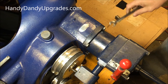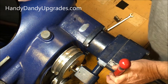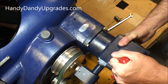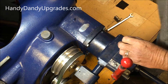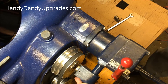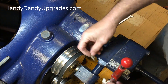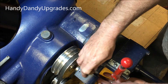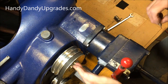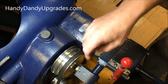There are three adjustments you can make to correct that. The first is you can move the gearbox back and forth. The second is you can rotate this a little bit back and forth to get it to line up. And the third is you can place shims in between the body of this and the body of that to move it out — giving you this angle, this dimension, and rotation side to side.